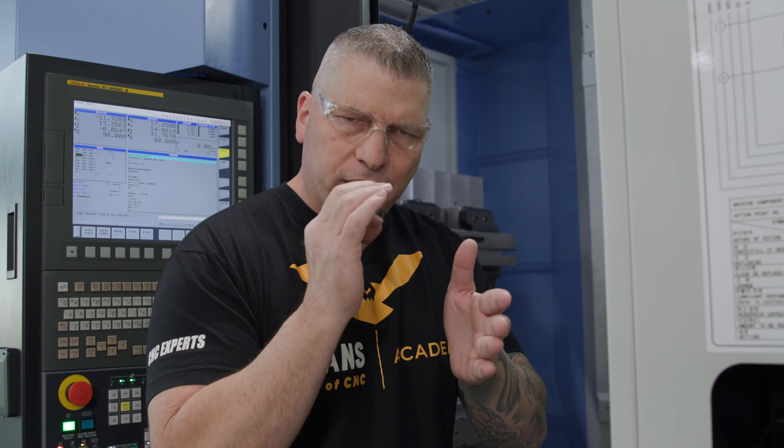That was a crazy cut — I'm like a little kid, I get all excited. When you see these videos and you see people dropping down full slot, you've got to look at the surface foot, you've got to look at the chip load, and you have to look at the width and the depth of your cut. Because in this business, when you're roughing, it's all about MRR — metal removal rate. How many cubic inches of material is coming off per minute? That tells the true story.